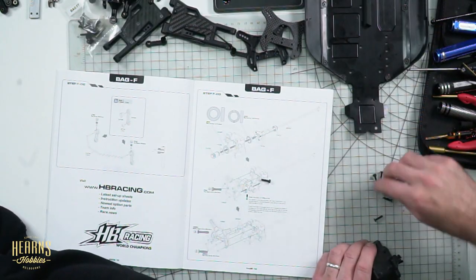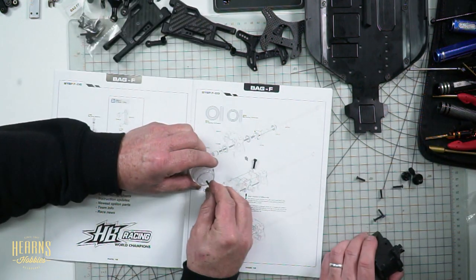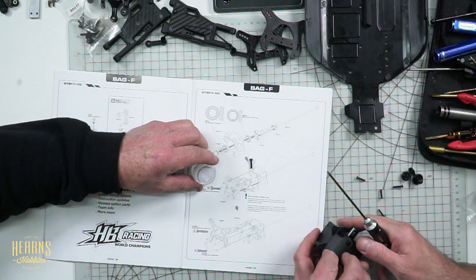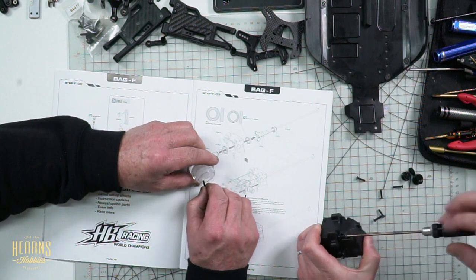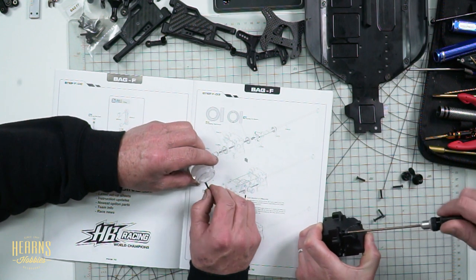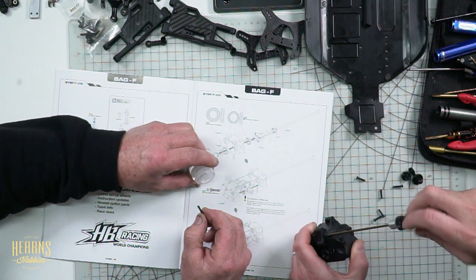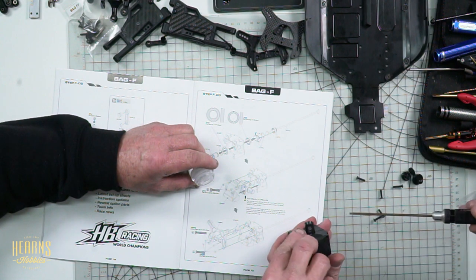So I'll get to bolting it in then. You put some screws in. You need some lube on them. I need some lube on them, and I need a 2.5 Allen key. Put it in the hole, mate. There we go, look at that. Doesn't even feel like I'm doing it up. Feels like it's going into a proper steel thread, not aluminium. It's good that I tapped it.